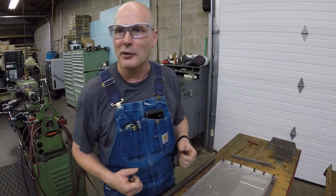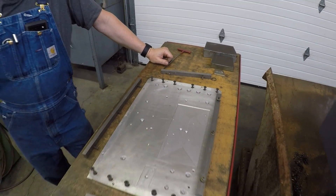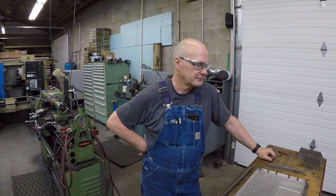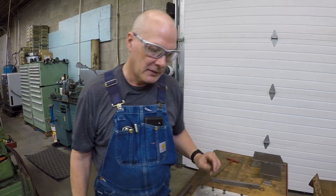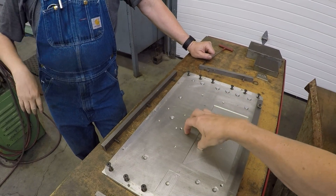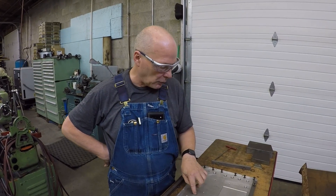Assuming this whole window is cut away on the part — do you just slot it out and have that piece of metal flopping around? You can machine the whole thing away. I'm lazy — I don't want to stand here wondering if it's going to crash or tear the end mill up, so I just cut it away. Given it's not supported anywhere in the middle, you can put one or two holes in here to stabilize it.